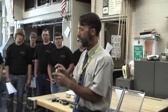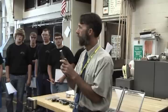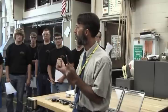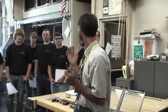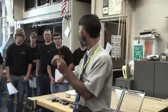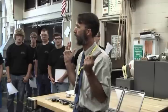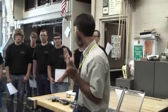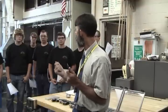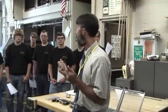High carbon steels. A high carbon steel is something that you can harden. Low carbon, you can't, no matter what you do. You can't get a good edge to it. Classic example, low carbon steel. Somebody give me some ideas if you know anything. Wire coat hanger, got the cheapest steel you can find. You could never make, for example, a good scribe out of a coat hanger because it would always get dull. It's always a soft metal.